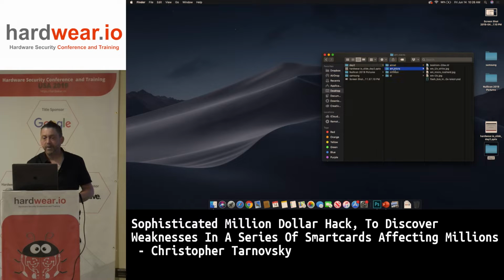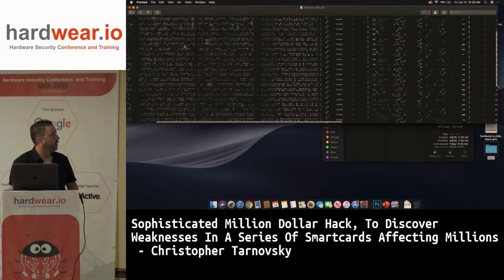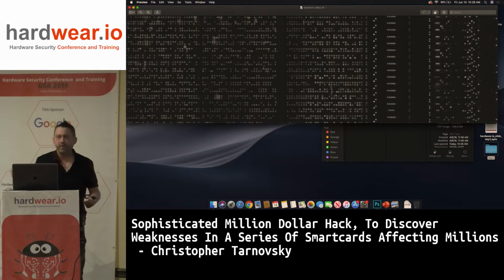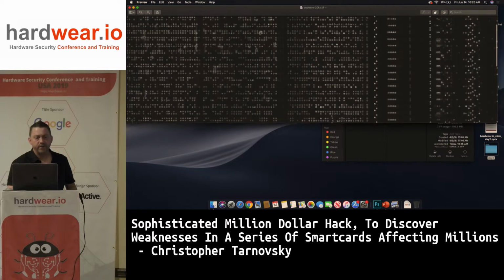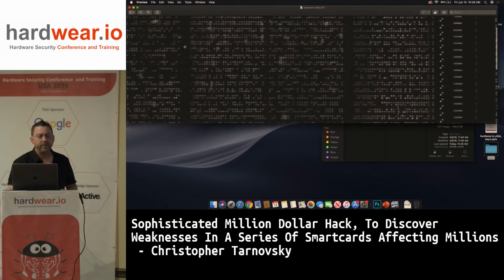Okay, let's talk about EM Micro. Chris Gerlinski helped me with this actually. This was their boot ROM, and this is polished. It's called an EMTG-I2C, something like that. It has an I2C bus, and it got used on PS4 for the PlayStation aftermarket controllers in China. Chris and I imaged this in the FIB.